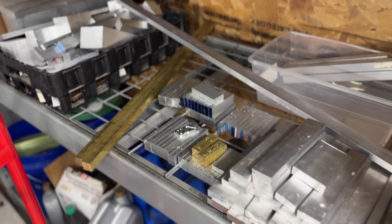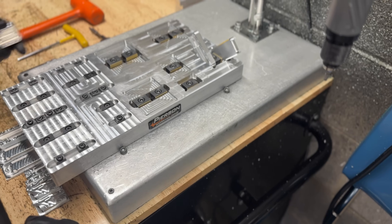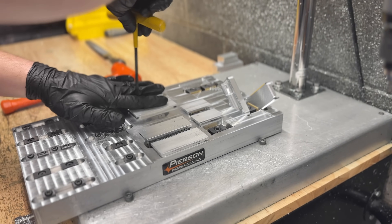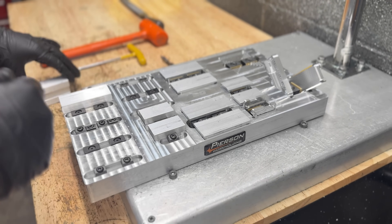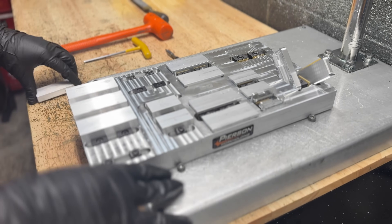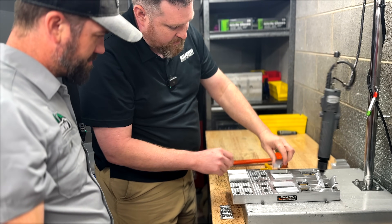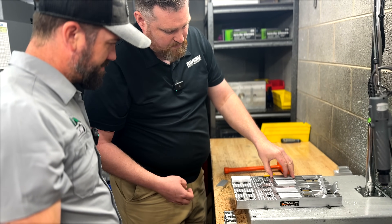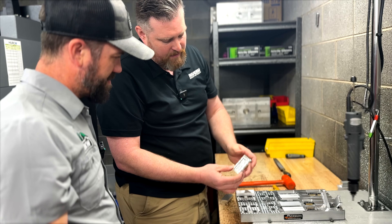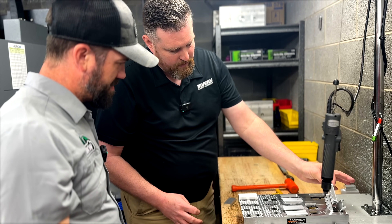Bar stock ends up over here. These are knives — this is the carriage, the lid, and the base. This is our fixture assembly station. Alex, who does all of our fixturing, will put the blanks in. They just go into these little fixtures. Everything in this fixture is set up so you don't have to guess — it all goes to a positive stop. Everything gets torqued, he drops them down, torques them, and as this gets machined it'll look like this. They get flipped over and moved to the next position, so every operation happens on this fixture every cycle. This base is three ops — op one, op two, and op three where it puts the lanyard hole in.